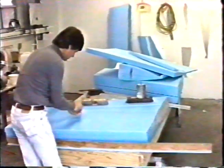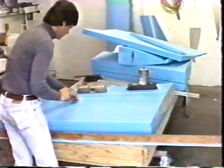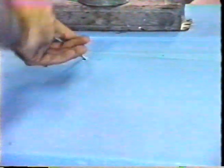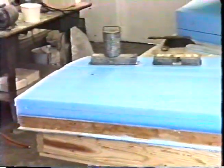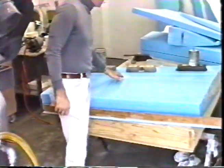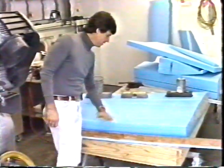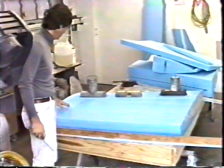The minor holes, small gouges that you'll find in your foam core, are of no great concern. You'll backfill them with dry micro just prior to your layup. They don't represent structural or weight problems. You want to make sure that your surfaces are well slurried. First, endeavor not to get slurry in these holes. You want to backfill them with the driest microfill you can manage.